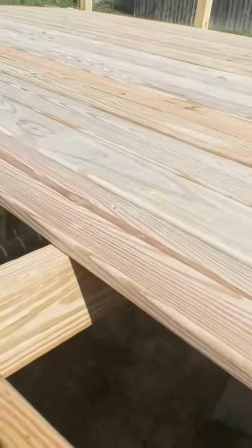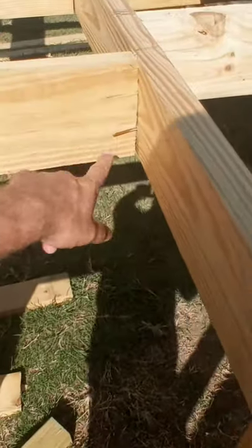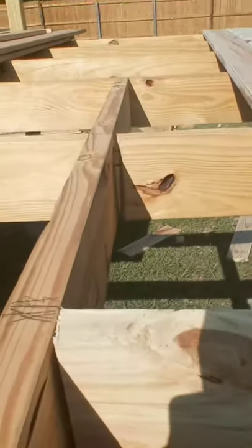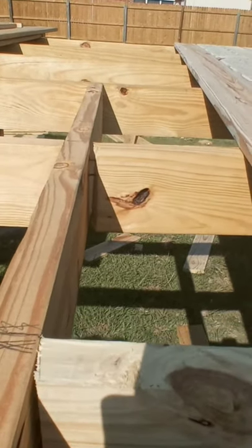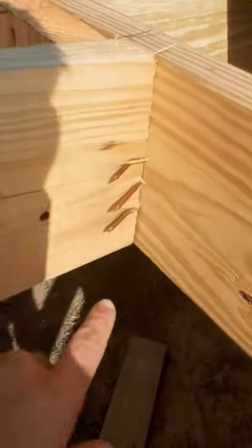As you can see, that joist has a gap and it's got one nail barely holding — he barely shot it through the side. These particular people have grandkids who are going to be playing up on this deck, so we can't have nails that are only one in and one missed. Right there is a big gap on that joist. And here, all three nails pretty much missed — this guy just doesn't know what he's doing. Completely unacceptable.